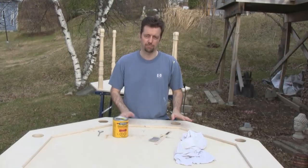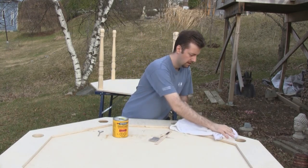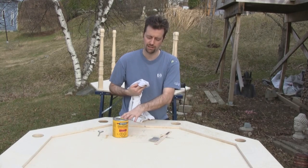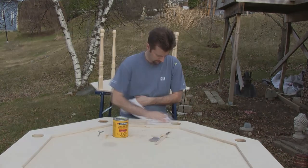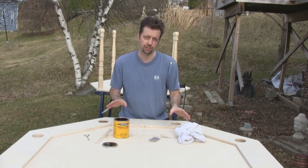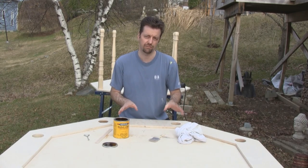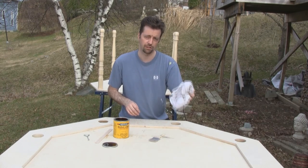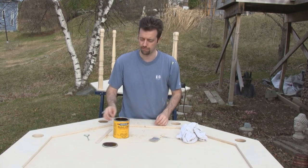When you've sanded the surface as smooth as you want it, use a damp rag to clean off any dust that's left. This will do two things: the water will loosen up the pores of the wood allowing the stain to soak in, and it will get all the dust off the surface. When you open your stain, give it a good stir — you don't want to shake it because you'll get bubbles in the finish. This particular one is Minwax and it says to put it on, leave for 15 minutes and then take off any excess stain with a rag. Follow any instructions on your stain so that you're doing the right thing.